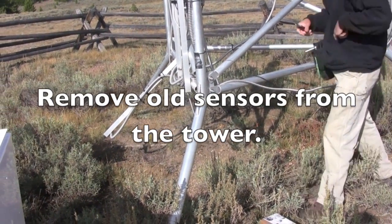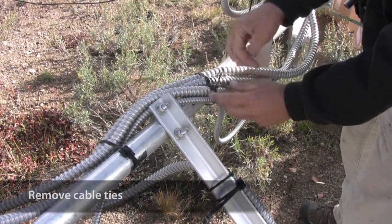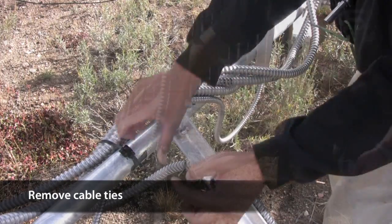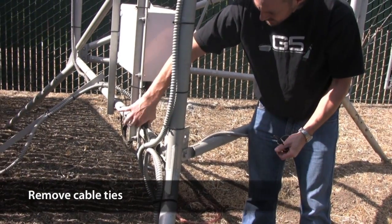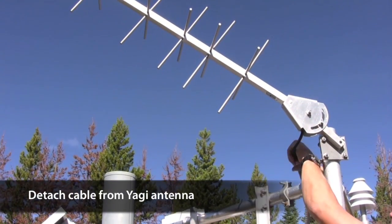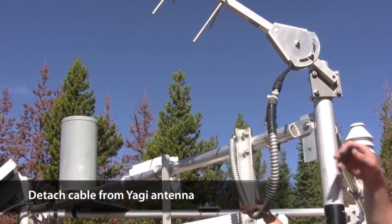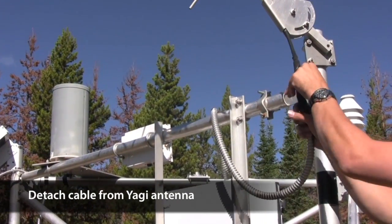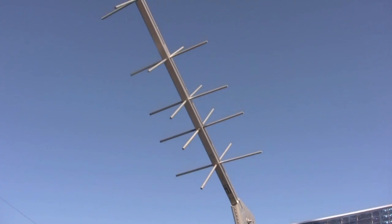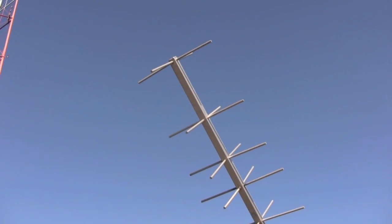Next, we're going to remove all the cables and sensors — after this the RAWS will be essentially bare. First, remove all the cable ties. Then unscrew the cable from the GOES Yagi antenna, because it will stay unless it needs to be replaced. But don't remove the antenna unless you have a compass to position a new one properly. Make sure all tines are not damaged and that they're tight and straight. Do not straighten any bent ones as they will break; instead document it and replace the antenna at the next service visit.